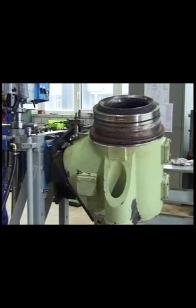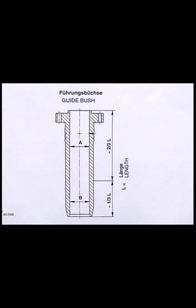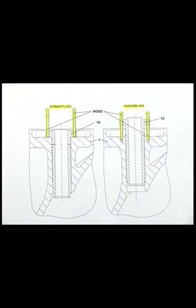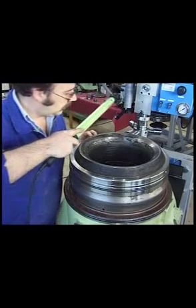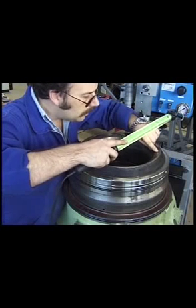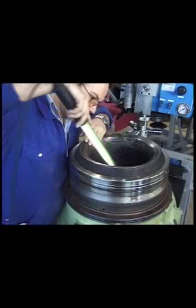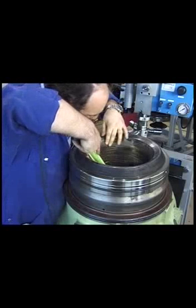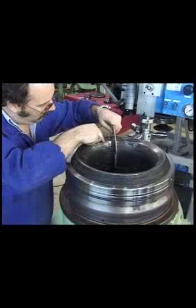Note: worn out valve guide bushes have to be replaced. Consult the maintenance manual for the replacement procedure. A valve seat must be replaced when it reveals heavy damage or more than 3 mm wear. Note once more that exhaust valve seats cannot be reconditioned.